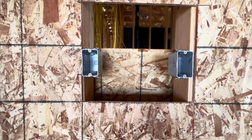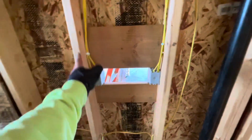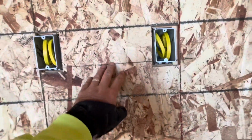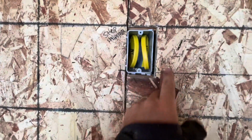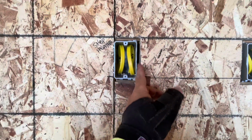All right, drop this wire in and close this back up. So I just took a couple of big boards and cut them and put backing in on that. And then I notched this guy out, and let's see if it fits. Yeah, perfect. So it's got some gapping around here, but drywall will cover that. I'll probably glue something in there. I'll probably glue a board onto the back of this to close up these little gaps.